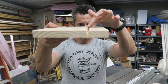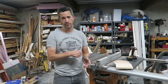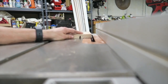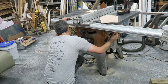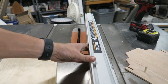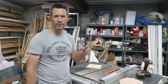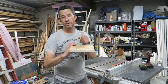To make the base, you're going to buy that one-by-eight piece of pine and cut a groove in it. The groove is about halfway through the wood and it is at an angle. The best way to do that is on a table saw. Set your wood on the table saw and bring the blade down until it is about halfway through. Then turn the angle on your table saw to about 10 degrees. Run it through, then shift your guide over a little, lock it down, and run it through again — about three times total — until the groove is just wide enough for the board to go in easily without binding but without flopping around.